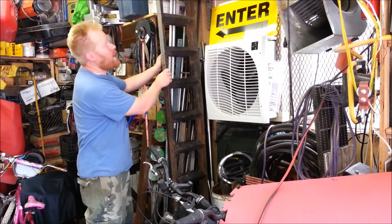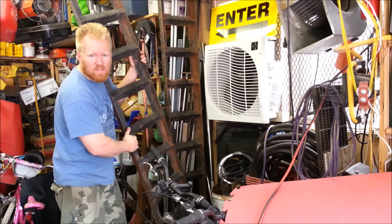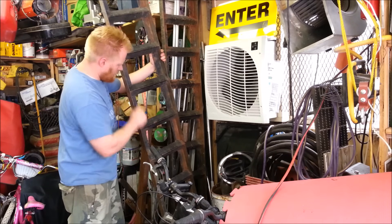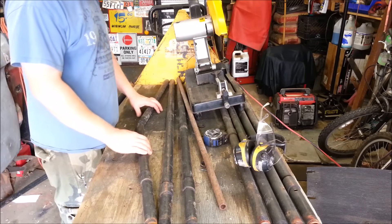I've built quite a few ramps over the years. If you want to build ramps and just be done with it, just go to the metal yard, buy a couple lengths of angle iron, and weld it up — two lengths of angle iron, cut pieces about 10 inches apart or so. I've already started cutting up some stuff for the ramps.